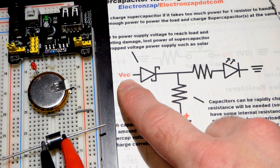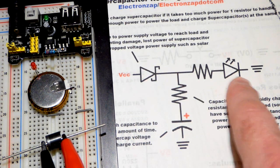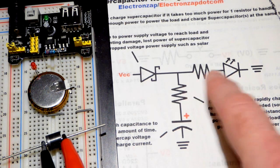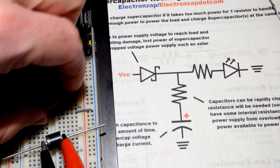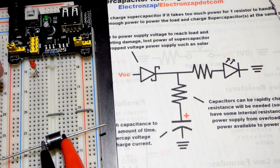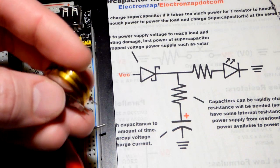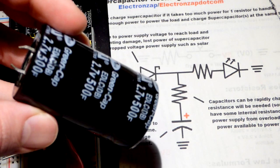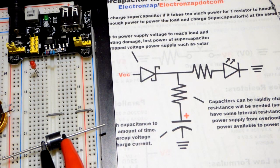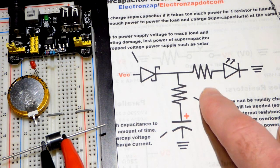We're going to look at losing the power supply altogether but we want to keep a small load powered. In this case it's going to be an LED with a protective resistor. We're going to use 5 volts here but the exact voltage doesn't matter — you just have to make adjustments to your circuit if you use a different voltage. This super capacitor is rated for 5.5 volts whereas these large ones are only rated for 2.7 volts, so you'd have to put them in series to handle 5 volts. Be aware you've got to make adjustments.